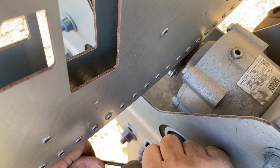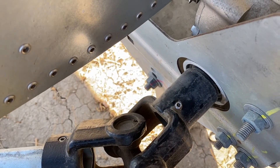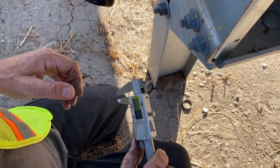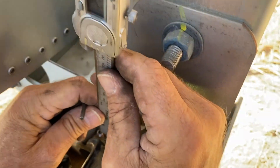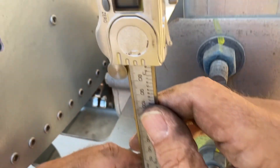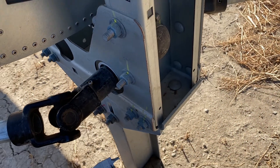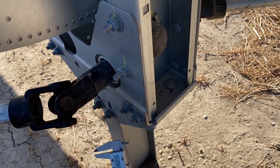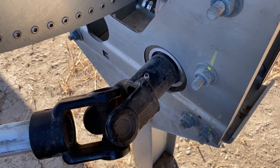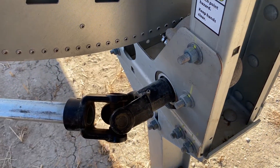This is good — it's touching, I can feel it's solid, it seated itself. Now reset this to zero, and here's what the proper set screw length should be: 4.98 millimeters. So about five millimeters, give or take 0.5 millimeters, and you'll be in that notch perfectly. At 4.98, that screw is embedded all the way down.